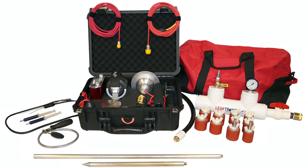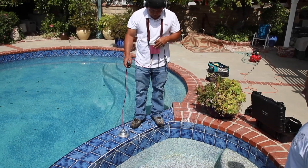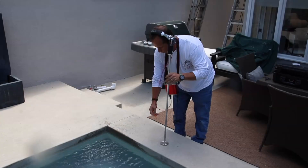In the ProComplete Kit, users will also find a deck plate and a soil probe. The surface area of the deck plate is flat, with no rubber rings or pronged feet extending from the plate — the surface area listens unencumbered by materials that muffle the leak and impede on the sounds it makes. This allows for supreme accuracy in underground leak locating. The soil probe gives users a range of ability for listening at the places where pipes and plumbing run under the pool deck, landscaping, loose aggregate, and soil.